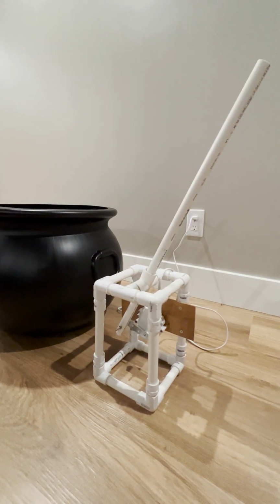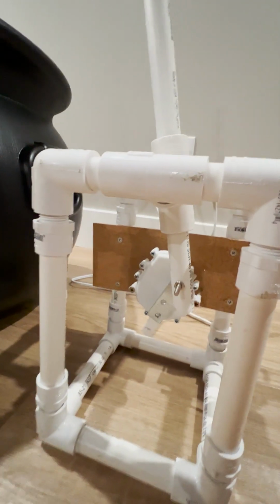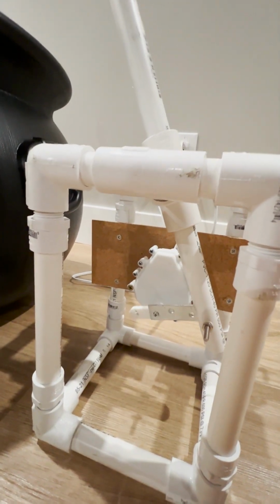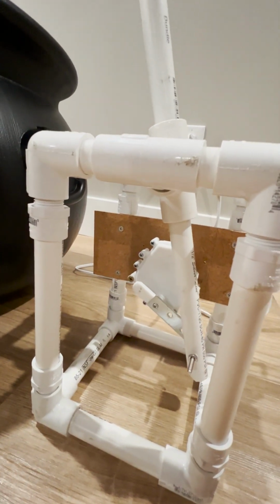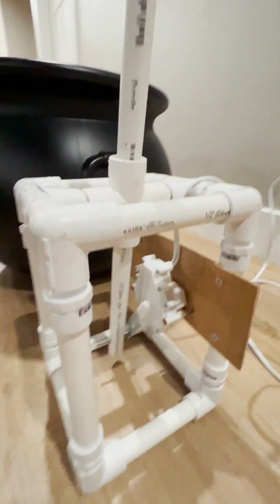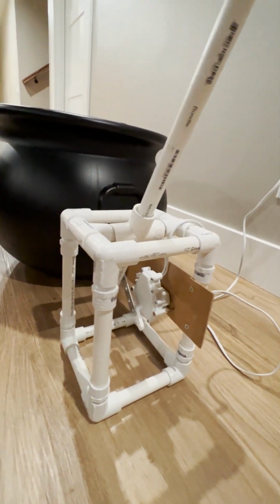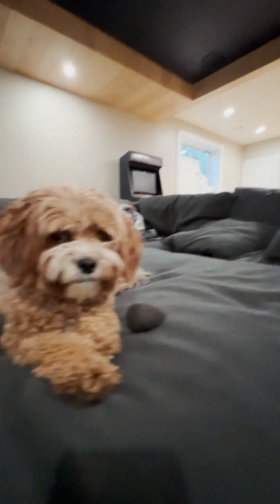I'm really new to the animatronic world, and this was my first go at it, so instead of going to a pick and pull and scavenging a wiper motor, I purchased my motors online from Monster Guts. I also purchased a speed controller from them as well, and I'm really happy I did. The wiper motor they sell has 2 speeds, fast and slow. When you attach the speed controller, there is a little dial and you can turn it up or down and fine tune it to control the speed you want it to be and how you want it to look.